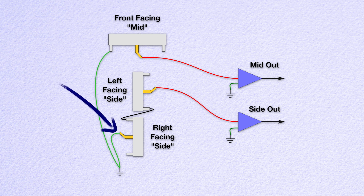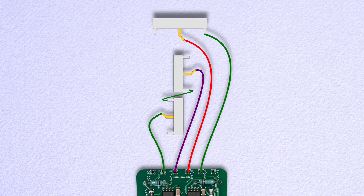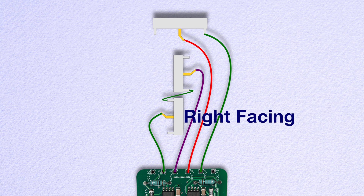This actually works really well. The purists out there may notice that the capsules are not perfectly aligned or 100% coincident — all I can say is listen to it. Tabitha sounds and works great. Here are the full connections: we connect the mid to signal A of the dual OPA board and its ground to channel A ground. The capsule signal of the left side mic goes to signal B, and then the wire coming from the right-facing capsule center terminal goes to channel B ground. These are virtual grounds that are not at the exact same voltage, so do not connect them together.